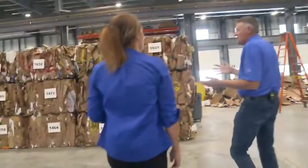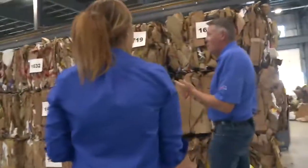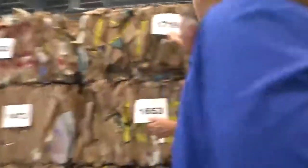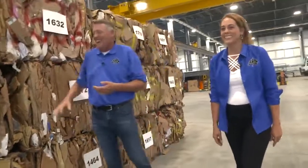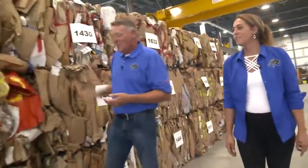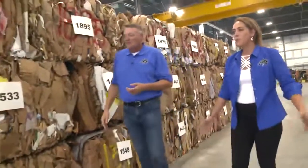This week we ran some cardboard bales — this is run with the system you see here. You'll see some different bale weight sizes. We ran some lower bale weights — this is for an export model, and we ran those at 1500 PSI, making them shorter. Here's a nice heavy bale — that one's my favorite — 50 horsepower at 2400 PSI.